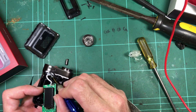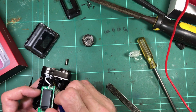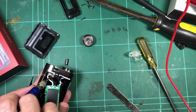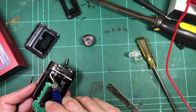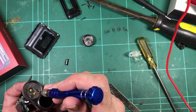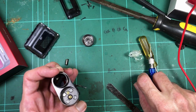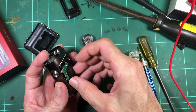Because they've soldered them. They would have soldered them onto the pins and then had a little tube or something and applied that goo there. But around at the back, you can't really get it all the way around, so I can see a bit of a gap there where I haven't quite got this sealing compound all the way at the back. So it could happen that liquid could eventually start to work its way down through this pin. There's got to be a little gap where the pin's springy. Don't have juice pooling up in there and ignore it, because it's grotty anyway, so clean it out if there's liquid in there.